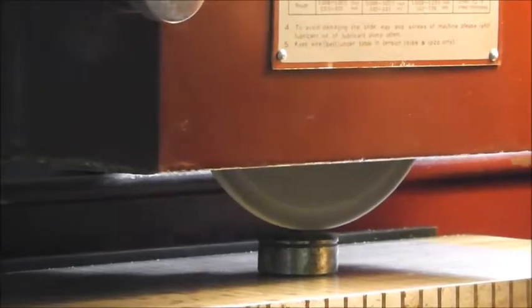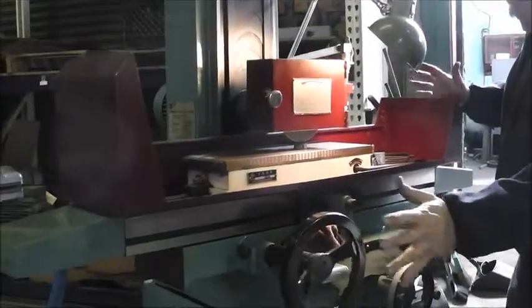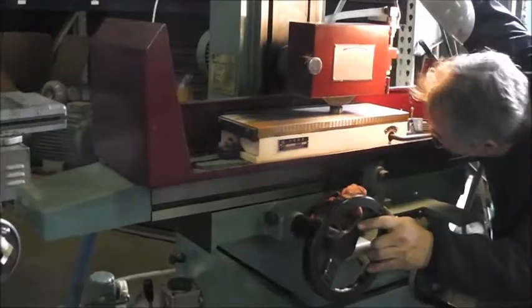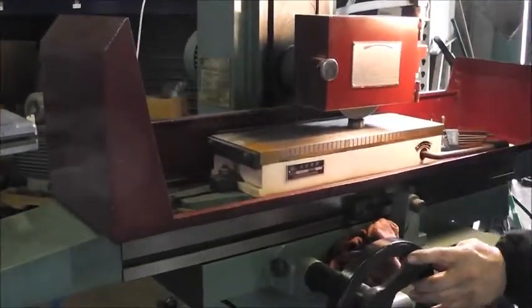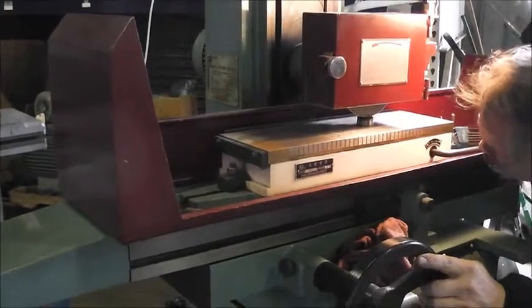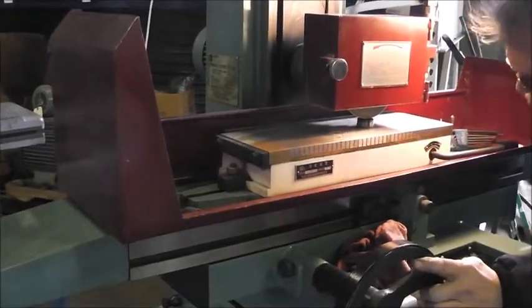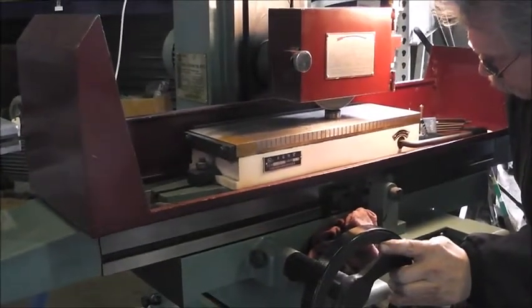What you generally want to do here is touch off with a piece of paper. It's difficult because of where I am — it's not level, it wants to roll. But if you put this right about where you need to be and you cut a strip of paper about a half inch, you drop it in there, and it comes down real gently until you can feel a little grab and it will cut the paper from your hand. Then you know your two and a half thousandths where you are before you make contact.